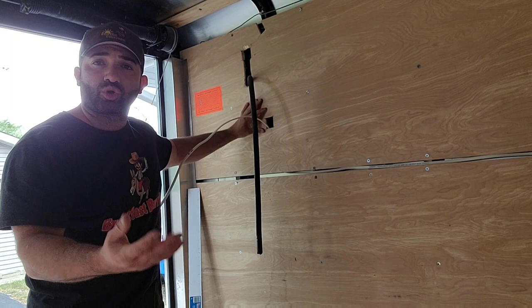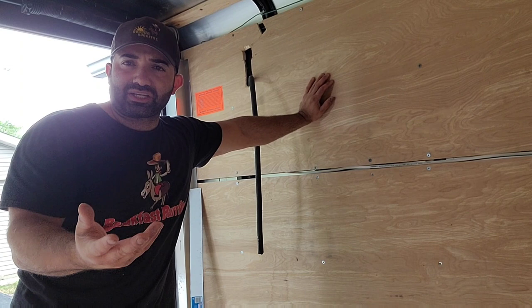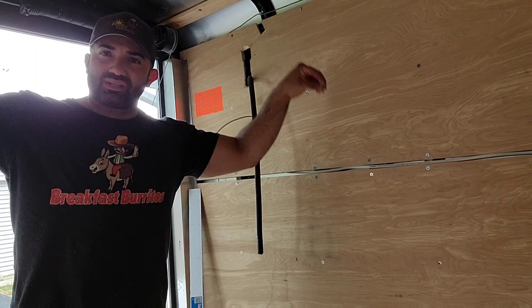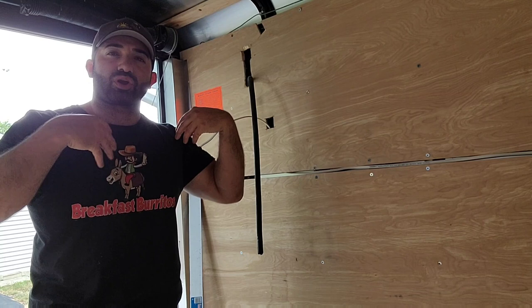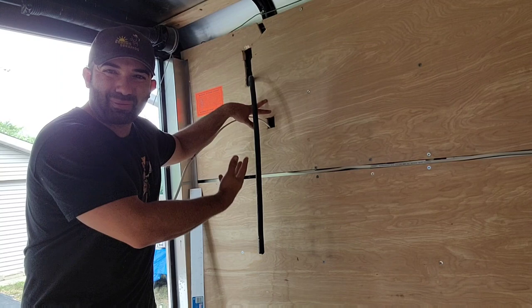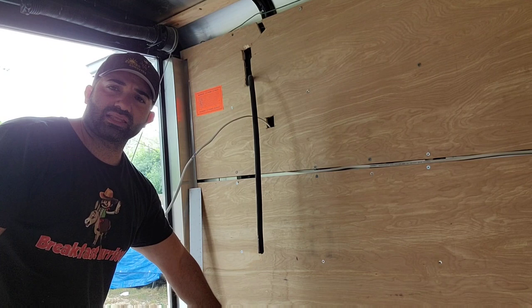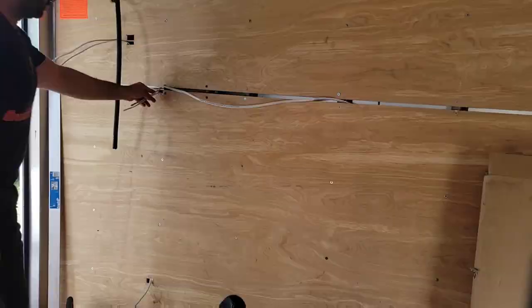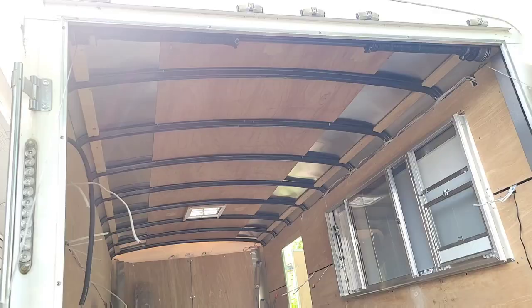This is going to be our home run hole. A home run is a wire or conduit that goes from the breaker panel to a destination. From there it can split up or be a dedicated home run — typically an oven or air conditioner has its own home run because the wires are large. In a kitchen it can go to the countertop and then distribute to the microwave, stove, or fridge, daisy chaining to other boxes. I'm cutting a hole here for our switch outlet for the fridge.